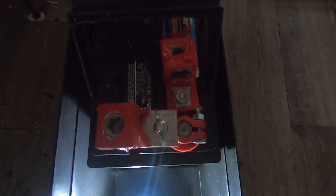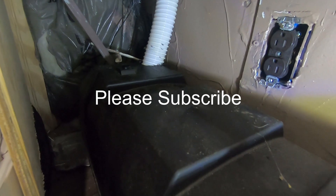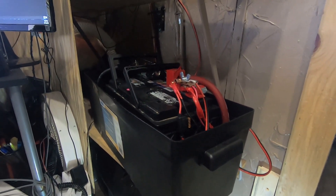Here's something I've done — lights are off. I drilled a hole low to bring the wires in. Remember, hydrogen goes up, so I'll seal this off with good tape but I want the hydrogen to go up. There's the hole where the wires will come in going to these lugs. Power's off. These battery boxes are vented to the outside — you can see the tubes that go to the cover. You can see the vent going to the top that goes to the outside — hydrogen rises up.